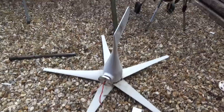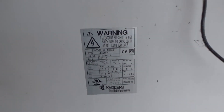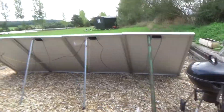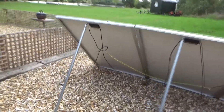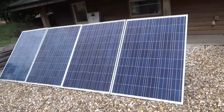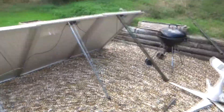In the meantime, the Kyocera series are out. These old panels from 2001, 120 watts each, were doing fine with my old battery setup, but now I've gone for four 235-watt Suntech panels. They're a fair bit bigger than the older Kyocera ones. It's mid to late September — the 19th — so we're not getting strong sun, and they're pulling about 790 to 800 watts in good weather.